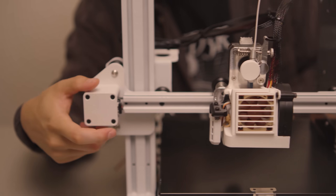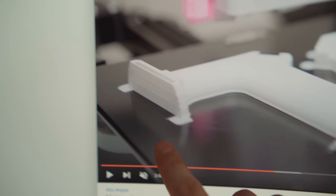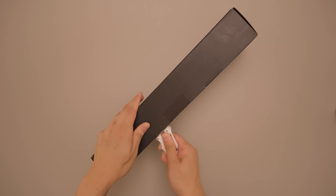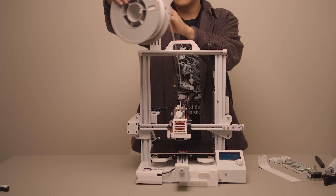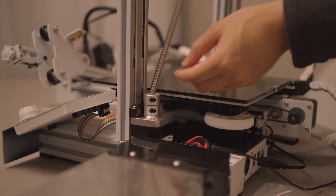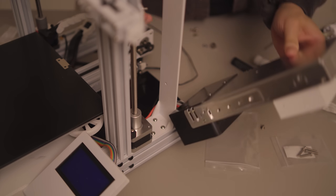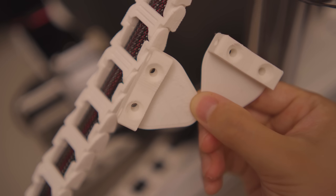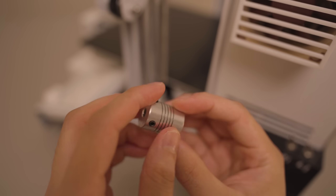You see how one side of the x-gantry is rigid but the other side wiggles? That's because one side has the support of the z-axis rod and the other side does not. I honestly didn't think this would be that big of a problem, but recently when I was printing larger parts that spanned across the whole print bed, I found that on one side there were always more issues with bed adhesion, elephant's feet, and other quality issues. So here's the dual z-axis motor upgrade kit. It comes in black, but that can be fixed. It comes with a bracket that pushes the power supply unit back to make room for the motor. I also reprinted the spacers I had installed before for both sides so they matched. I then replaced the coupler that came with the kit with a more flexible one, since they're a bit more forgiving to minor misalignments.